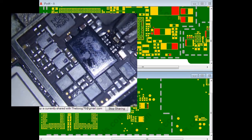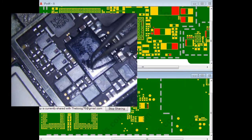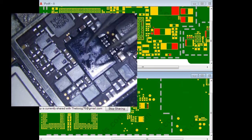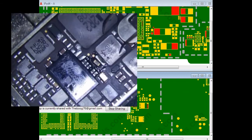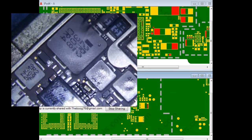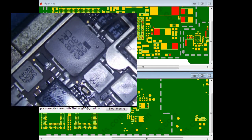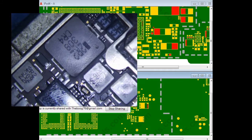After I did this, I contacted the customer, and the customer said this guy took it to the Philippines and it died over in the Philippines, right? So my guess is that he probably plugged in some sort of charger that is maybe not a high voltage charger or something like that that fried this thing. That's my guess, because this is naturally a short anyway, so even though it gets hot, I don't think this is the actual problem. I just don't see how it can short the ground, because it's really just a coil of wire in there.